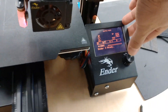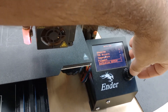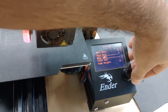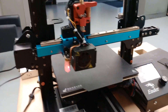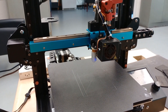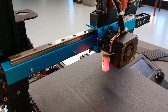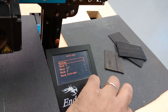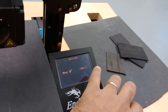I'm going to pull out the SD card. Over here in configuration, advanced settings, initialize EEPROM. Then go to motion, then auto home. And as soon as we hit auto home, this is what's happening — this is the problem people are having. It will not probe downward, and then if you try to move Z, it will not move down no matter what you do.